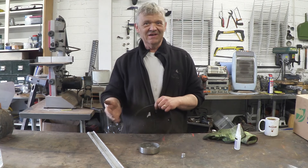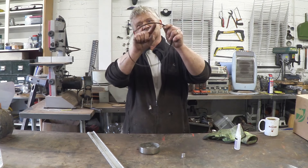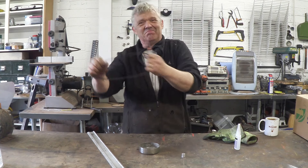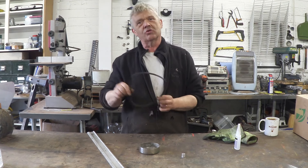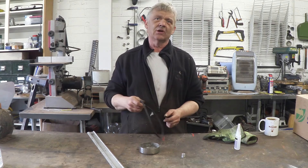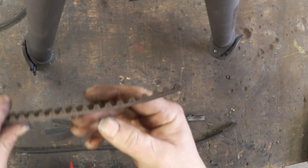What I find works really quite well is somewhere greater than three times until you get bored of doing it — that seems to work just fine. I'm holding a belt here and there's a scarf joint right there. You can put some tension on it; this has actually been in a machine and I broke the cog before I broke that joint. Let me give you a close-up — it'll make a lot more sense when you see it more closely.